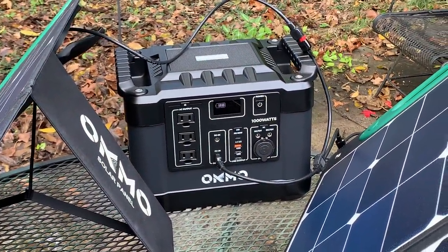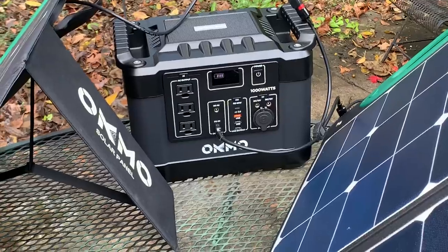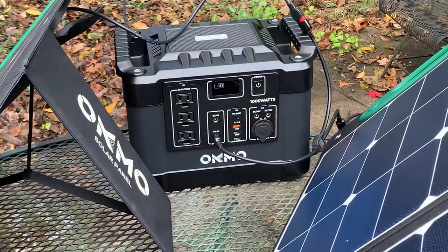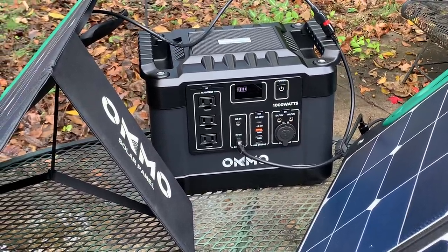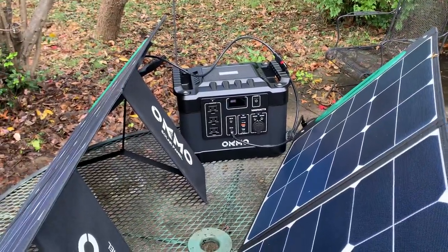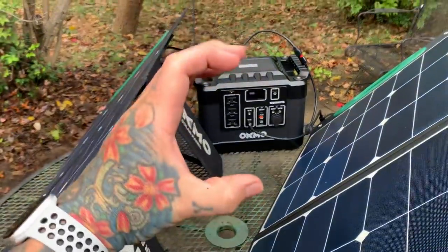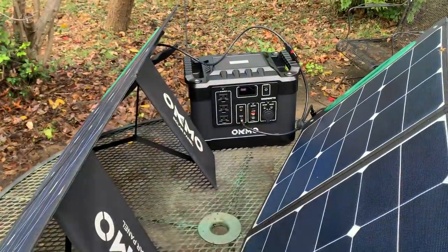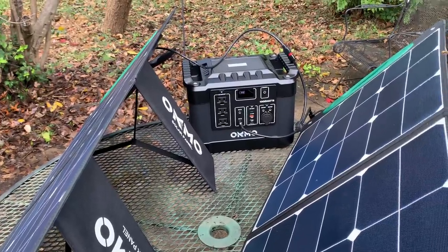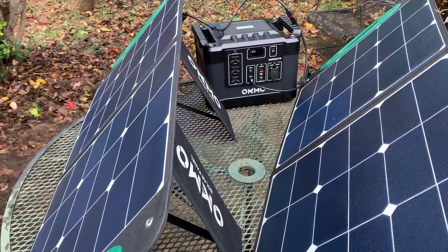You can power any size computer for quite a long time. It's not made for portable air conditioning or high amperage devices. You could use a low-amperage efficient mini fridge off this 1000-watt unit, but it doesn't matter if it's a 2000-watt unit — the amperage is too high on those devices. When you see a negative review like that, they're written by people who have no idea about current. Anyway, this is the best value for the money — I paid for it, no kickbacks, no affiliate links.